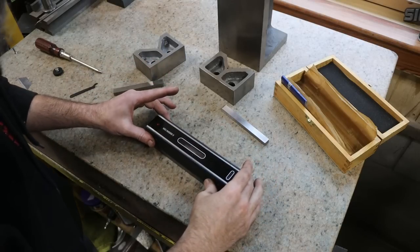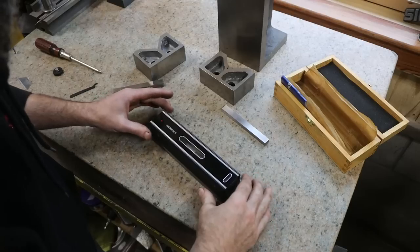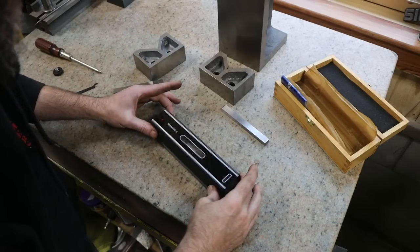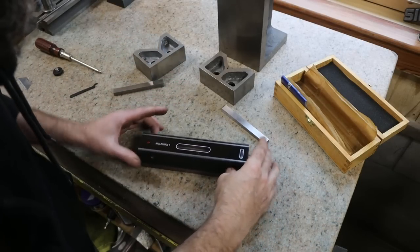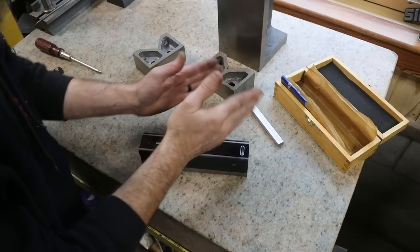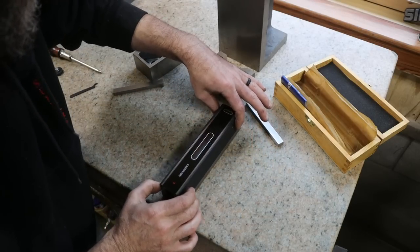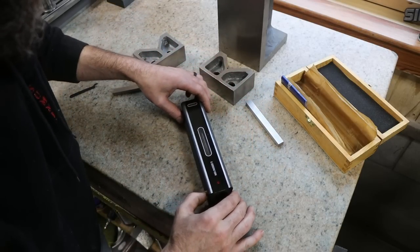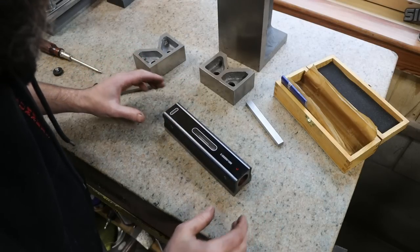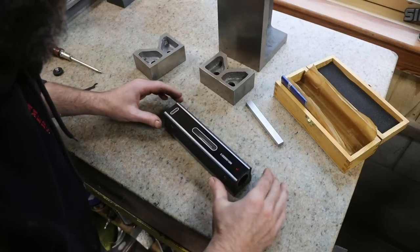We can rotate. It doesn't have to be level. This surface plate's not level. It's on casters. I roll it around. But this level's relatively close to accurate. I know that. So I can rotate this somewhere in 360 degrees of rotation. This bubble should, at some point, rest right in between the marks, and that's what I'm after. Let's rotate this until our bubble falls in the center. Oop. So we've got a level plane through this axis of the plate.